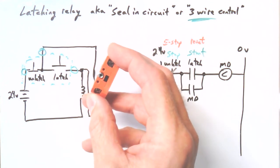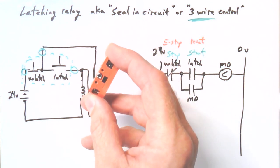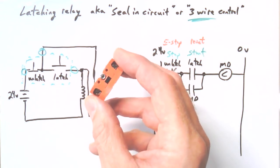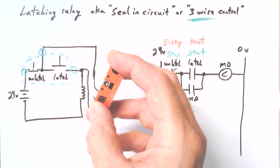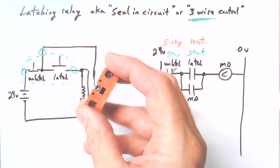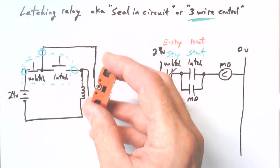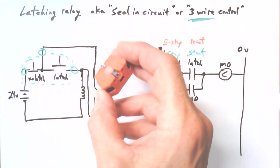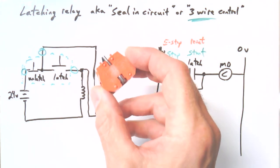That way, worst case, your actual wiring for your safety circuit is not intact. That's okay. That just means the machine comes to a grinding halt. It stops or it won't start. So you can't start the machine if the safety circuit isn't in place and intact, because it relies on everything being closed. So that means the wiring is good, if that makes sense.